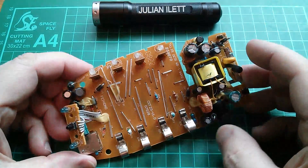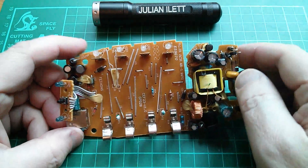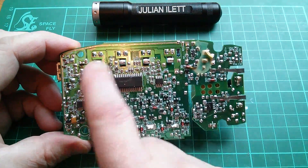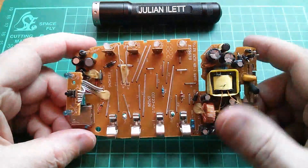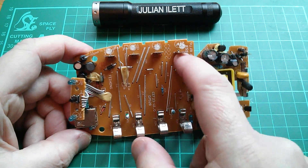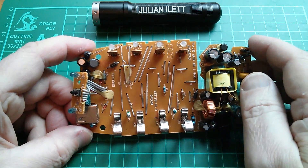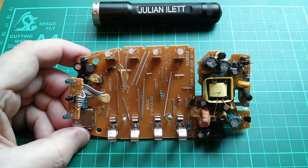Although I don't know exactly what this thing is doing between the two modes, judging by the voltages I measured and the sheer number of switching devices on the back of the board — 30 transistors — it's fairly obvious that this thing is being rewired to some extent between modes, with the cells all in series for USB output mode. Although it doesn't appear to be passing battery voltage straight out to the socket, there's some sort of voltage drop — possibly just a diode drop. And then the cells are being reconfigured in some way for battery charging mode.